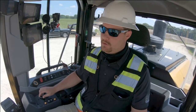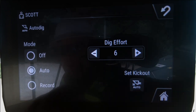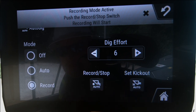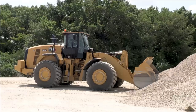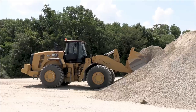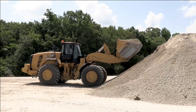If you're not happy with dig efforts one through five and want to do your own cycle, switch over to dig effort number six. You'll notice a record button pops up — you can record your own cycle and the machine will replicate it every single time. Hit the record button and a banner comes up indicating you need to record and stop at the end of the recording. Any implement movement made while in the pile will be recorded — the machine is recording everything being done right now. When the dig cycle is finished, stop the recording and all those movements are saved under dig effort six.